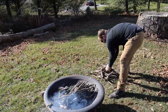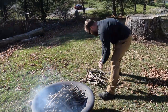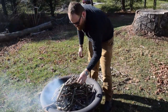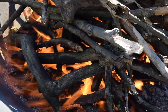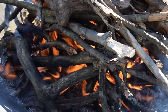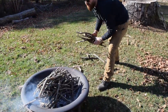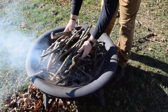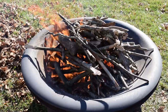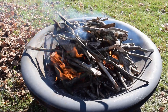So we're gonna build it back up. Put some wood on top, get everything cooking, and keep the fire burning nice and long, a good hour, maybe more, and then we'll just let it cool down on its own. The fire will burn all the way down, and then the files will cool down on their own, and that'll anneal them. So cooling down slowly lets all the molecules, again, move apart. Wind's doing the work for us.